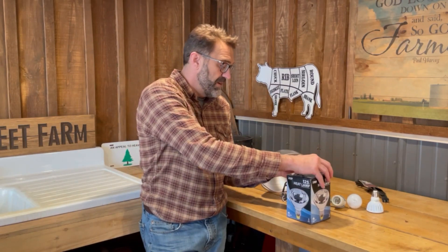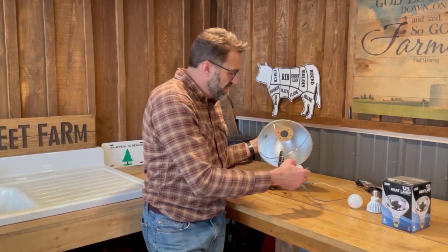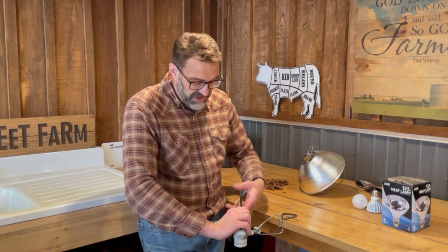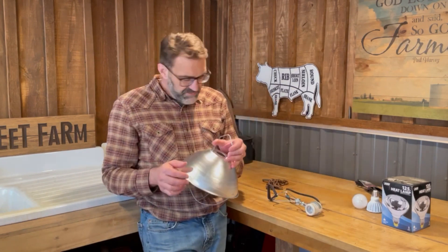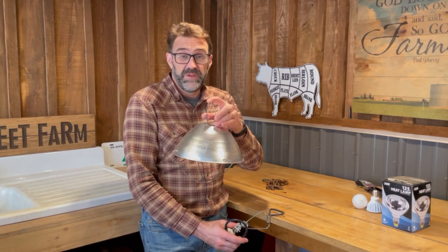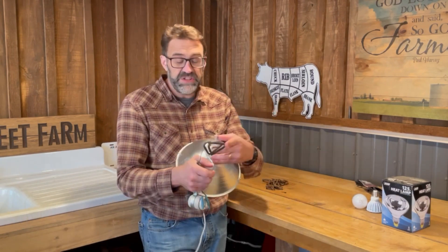These bulbs do put off a lot of heat. We do use them, but I've adopted a practice for safety. You can get heat lamps with clip-style bases and latch them onto a board — that might work for chicks below it for a while. But if you have lambs, goats, baby pigs, or any bigger animal that may hit and knock it off, I would not advise that. I'd really recommend you fasten it securely above, doing double due diligence by attaching it twice, or don't even use the clips — they just scare me to death given what we've seen.